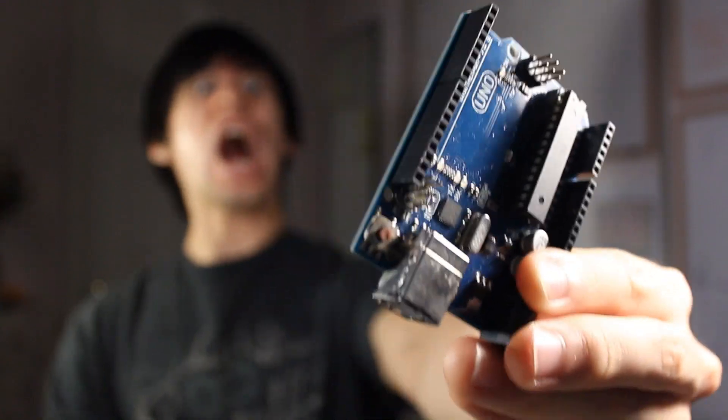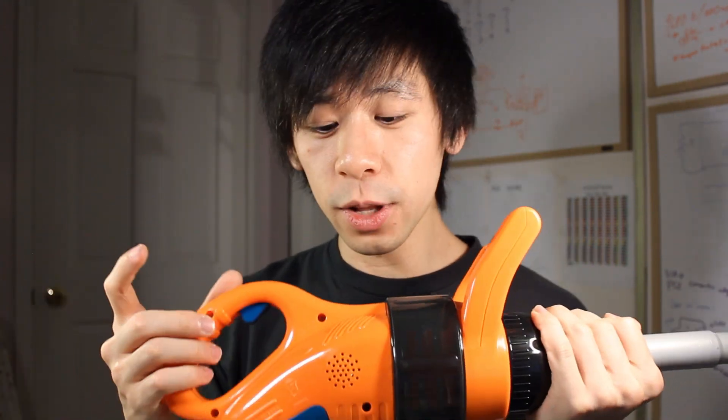But it's not over. The frequency of oscillation is in the hundred kilohertz range, which means it's nothing we can hear — so what do we do? Arduino to the rescue! We'll feed the oscillation into a counter, and when the trigger is pressed the Arduino will translate that oscillation into an audible tone played out the speaker. And just for fun, when the oscillation exceeds a certain threshold, we'll turn on a light show — why not?